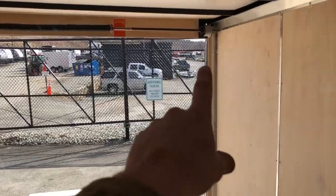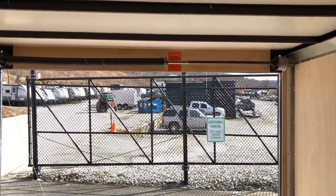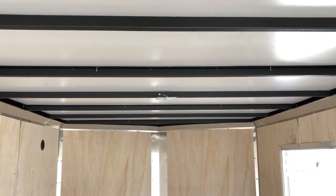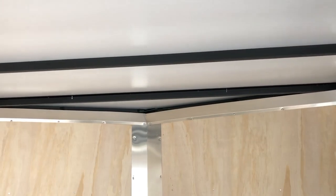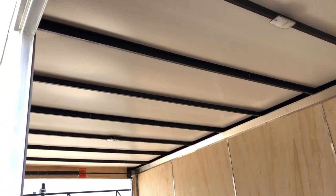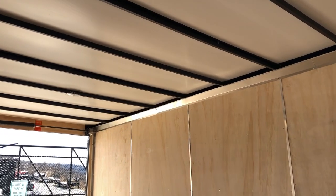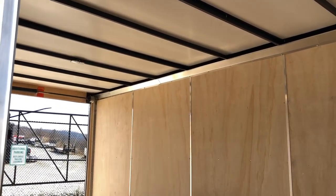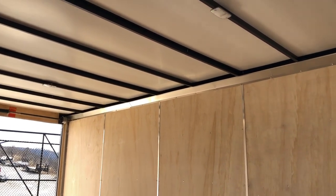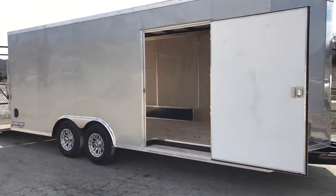The back corners use plywood that's easy to take off if you need anything. Same thing behind the spring header — they're putting plywood up there instead of a piece of aluminum trim. Above the roof bows you can see the white ceiling liner. That is a thermocool material that has a nice look but also has a reflective insulation property. It's got a thin piece of reflective insulation sandwiched between cardboard-type material. Above that, you've got a one-piece aluminum roof. This particular trailer will tend to stay cooler than most, compared to the galvalume or seamed roof made of galvanized steel, which absorbs more heat.